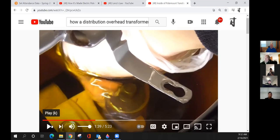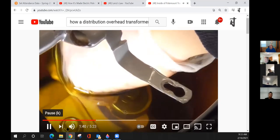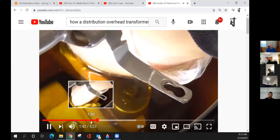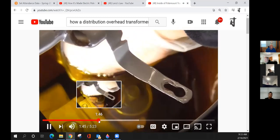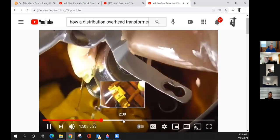It may be down across part of the windings, laying on something. It's going to cause a dead short inside that transformer. You don't need to risk it. You just want to stop what you're doing. It's going to be aggravating to have to go get another one, but you're going to have to get another one and start over with that. So anything dropped inside of it, just send it back in and let the transformer shop fix it. Good, nice, tight connection. All right, that's tight.